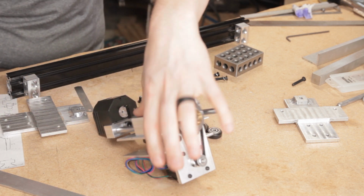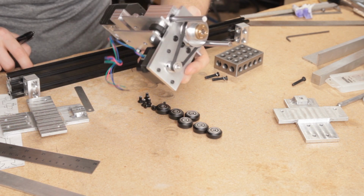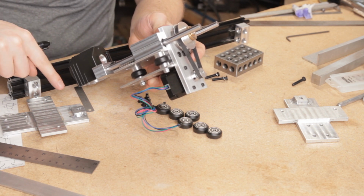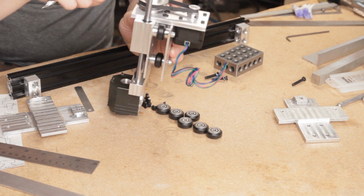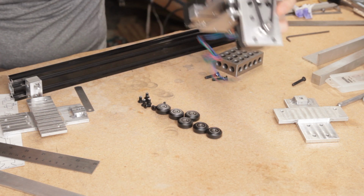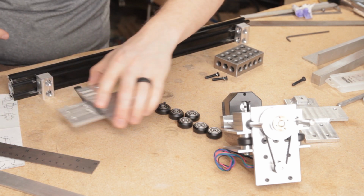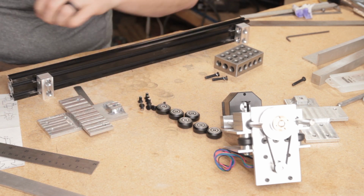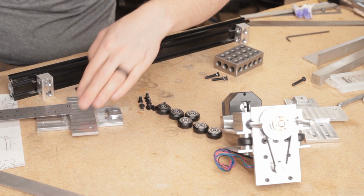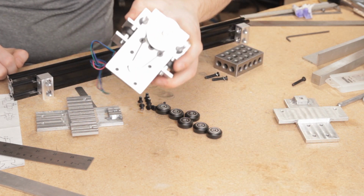Okay, so on second thoughts, it has to be to these top wheels, because obviously the pillar has to be the height of this, and then this is the height that the top wheel is riding on. So here to here, about 15 millimeters below here, which is probably approximately my minimal focusing distance, is 160 millimeters. This is set as low as is reasonable for operation whilst maintaining rigidity. And given the 100 millimeter height of the base, including this bracket height, that puts me at only 60 millimeters on the actual height of the pillars, and this length here is only about 47 millimeters, so the pillars are going to be very low, which means the whole thing is going to be extremely low and therefore highly rigid, which, considering the weight of this thing, is fantastic.